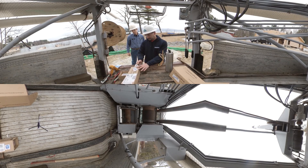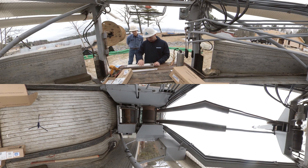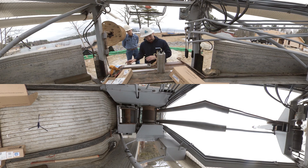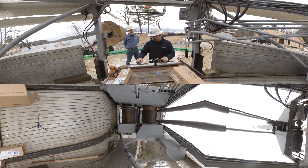We're now ready to assemble the pump onto the motor. With the cable guard removed, we're going to verify that the wet end turns freely before we match it to the motor, and we'll do the same on the motor to make sure it's not locked up. We'll lay them down, align the splines, and tighten and torque the bolts evenly. We'll then remove the cable guard from the wet end and bolt the motor and pump together.